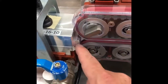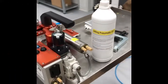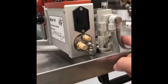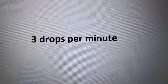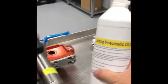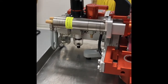Increasing air to the motors means increasing speed and power. Always use the Jetting pneumatic oil — it is supposed to drop three drops per minute, and you regulate it by the transparent knob. Beside that container we have a water container, which is the water separator. It's important to have it emptied.